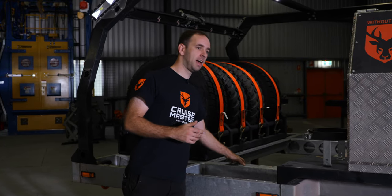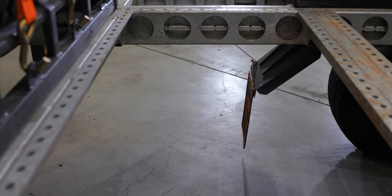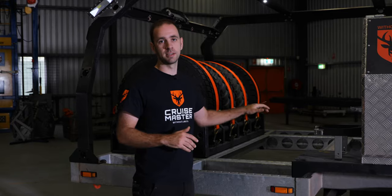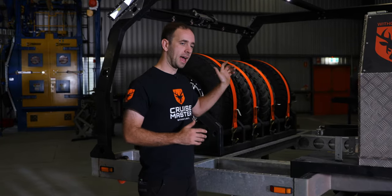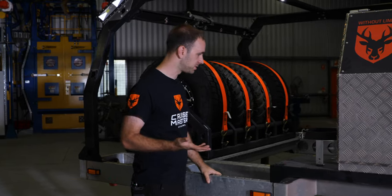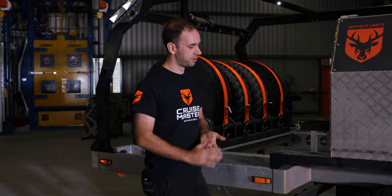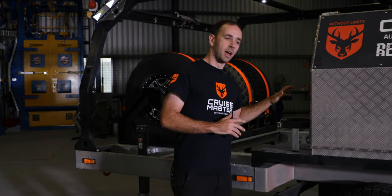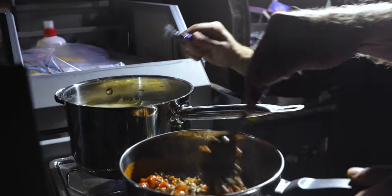You can also see from the other side there are big holes and channels in the chassis — this year we wanted to make sure brake wires and lights weren't going to get cut through by rocks, so we hid them inside the chassis rail. We could still get to them if needed and they were completely protected, which was great. It also allowed us good access to the bolts holding the suspension frames into the trailer. Underneath there's a big 150 chassis member that takes the main suspension loads from the road and transfers them into the trailer — a nice strong section. We've also got gas can holders on the back.